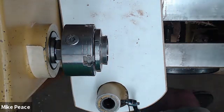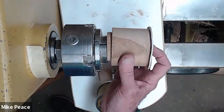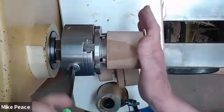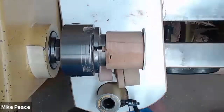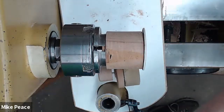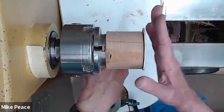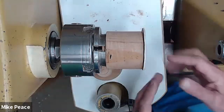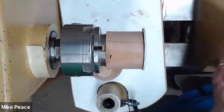I'm looking for something to best illustrate that. This is not a perfect example, because this is really used for a pressure chuck, or maybe reversing a bowl, but this is giving an example. So say this is not on here. I've just got this perfectly smooth wood face. And then I have another flat apparatus that fits on my live center, like I showed you, that you can make, that's perfectly flat. And you put the piece of plexiglass in here, bring up that other circular piece that's exactly the right size, like that, and then you come behind it, the side here, and just cut it off, and you've got this perfectly round piece of plexiglass.